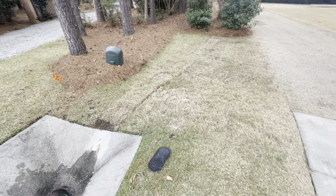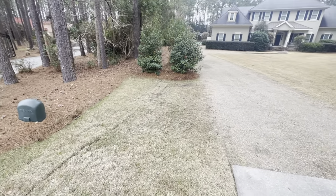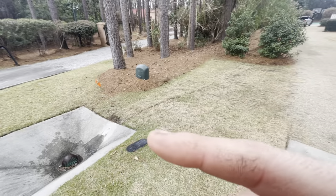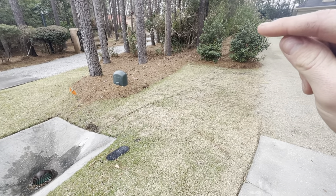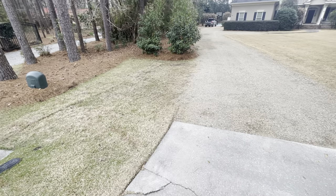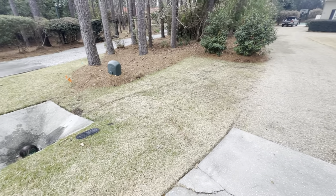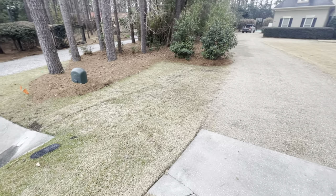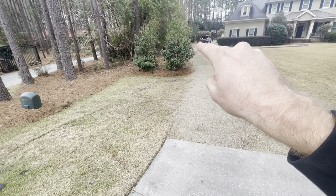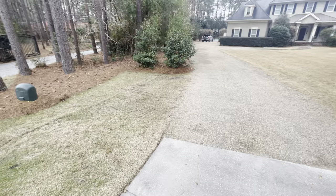That wasn't really the best example — when it's raining hard, this thing's continuously pumping water out. We just installed this system about seven months ago, the grass is still healing up, and we haven't had one issue out of it. We've had a lot of heavy rainstorms and it's been performing super well. The reason it's not constantly flowing out of here is because this pipe's pretty loaded up with water. Those two pumps are moving water in a three-inch line all the way up here — about 160 feet — so probably a little more than they're rated for, but it's been working really well.